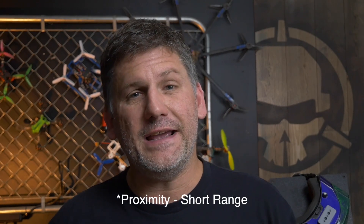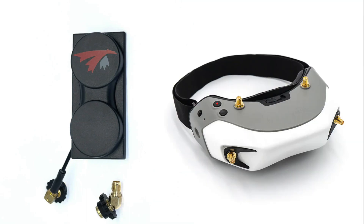I want to share my real-life experience because sometimes real-life experience differs from physics on paper and testing things in your backyard — it's possible we are not 100% aware of the physics surrounding us in our specific situations. Specifically, I'm referring to flying FPV with goggles on our head. Physics may lead you to believe that flying with all crosshair antennas and no omni antennas on your goggles will be less desirable in most situations, but I want to show you why I believe flying with quality crosshair antennas on all four antenna ports of your goggles is the right way to go in almost every situation.